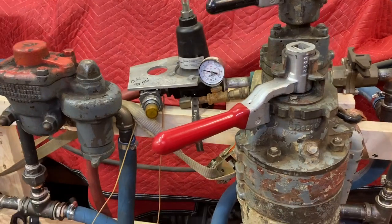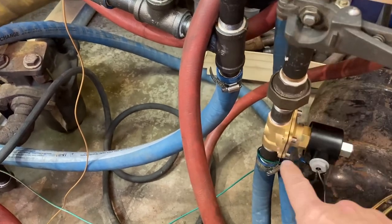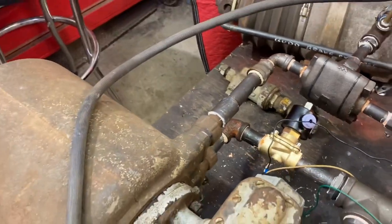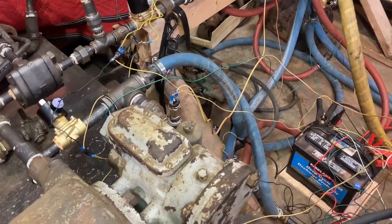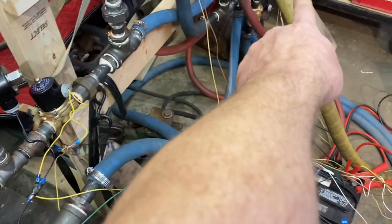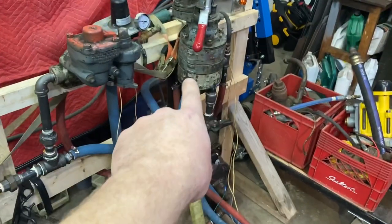The reason why it's not blowing down: I've added the lockover system. I've put a solenoid valve right after on the charge line from the brake valve, and from the brake pipeline from the distributing valve, I have another solenoid valve as well. These are normally open. When the system sees an emergency pressure — this pressure switch looks for no pressure in the brake pipe, or 30 PSI is where I have it set — if it goes below 30 PSI, this valve closes, that valve closes, and bottles the air in the system. So this side is isolated from that side.